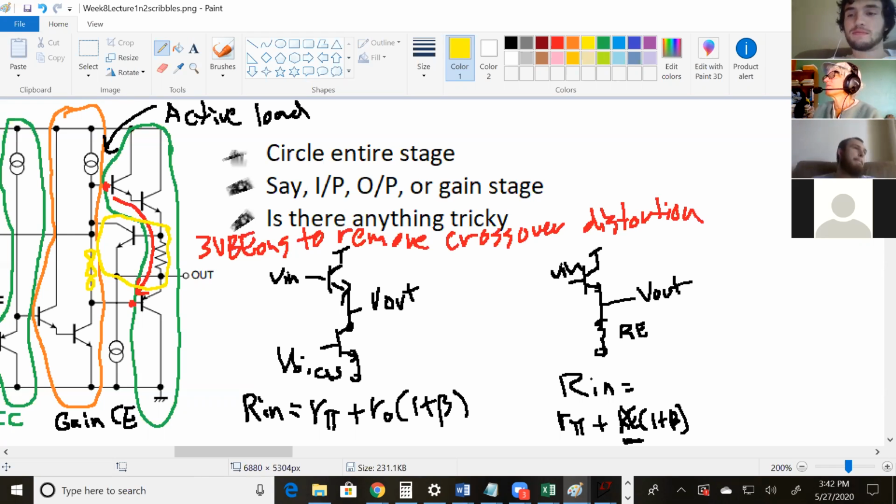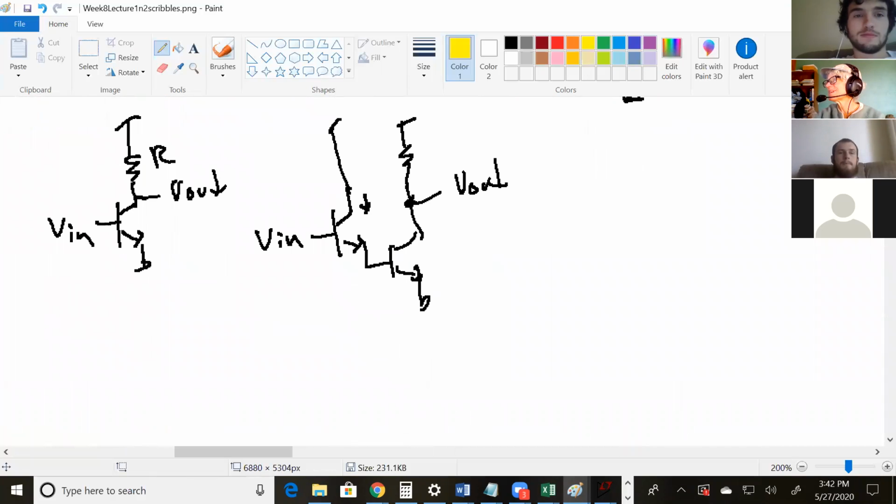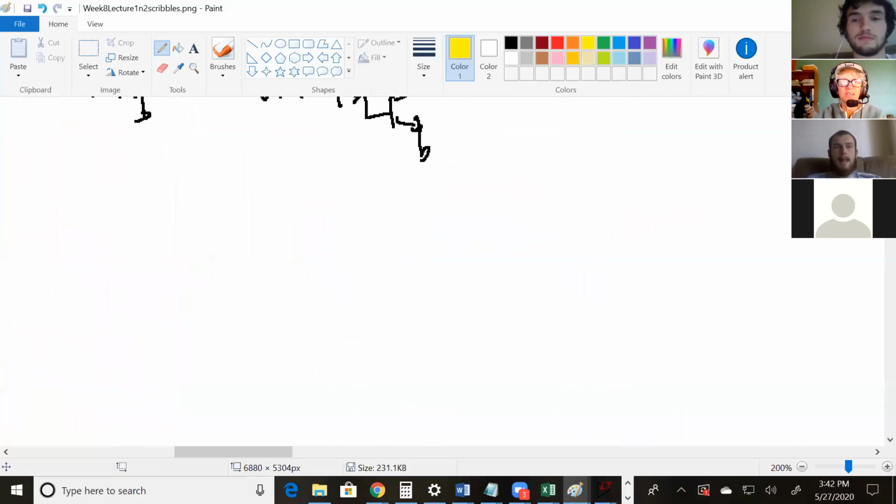Okay, so to figure out the frequency that our circuit can run at, we need to figure out how to find the perceived R and the perceived capacitance at a node. To do that, first of all, we have to look at the sources of capacitance, and transistors give you a lot of capacitance. Wires give you capacitance. Everything gives you capacitance, basically. But let's look at the BJT first.